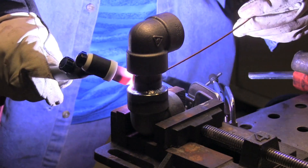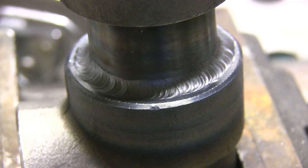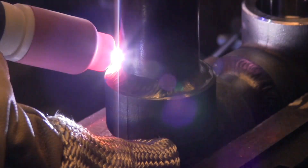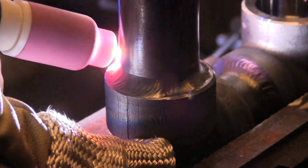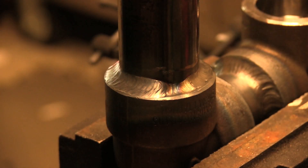With the Lincoln 210 MP, I've done some socket welds without a foot pedal using the lift arc function and it worked out really well. Socket welds typically are done in at least two passes — codes prevent doing only one pass on them. I'm doing a little root pass here and then coming across it with a second pass. I'm walking the cup for the first pass, and then doing a little freehanding, which is very common on small joints like this — especially when there's not access and another pipe is right next to it, you just can't walk the cup. Snapping out is the main ticket, but just hitting it with a file when you're done usually takes care of that.